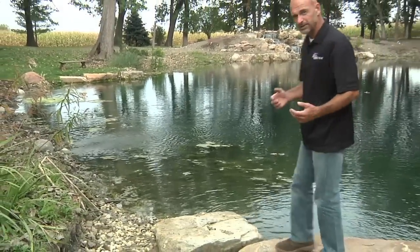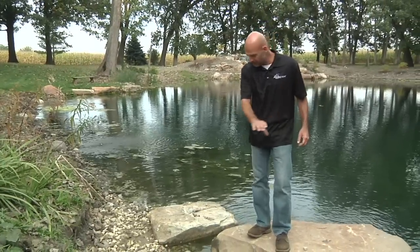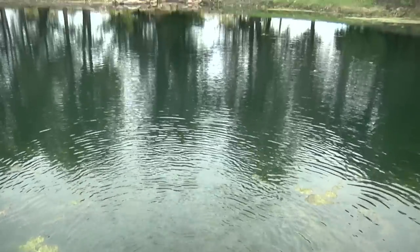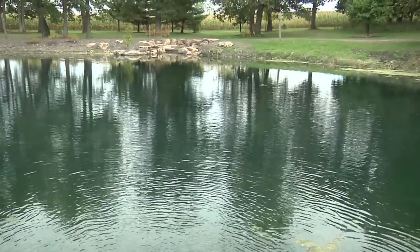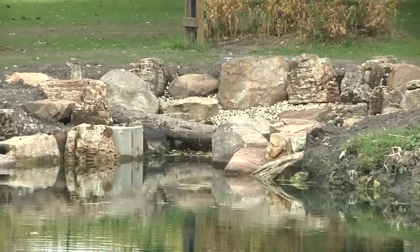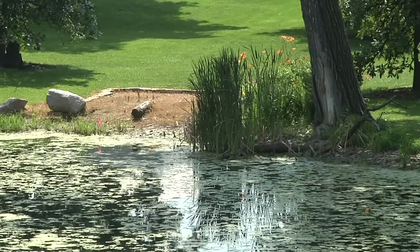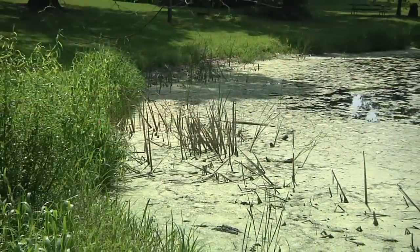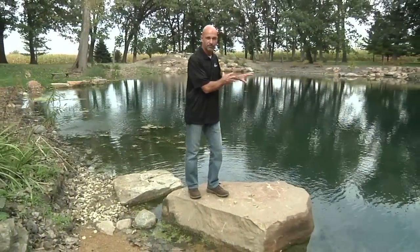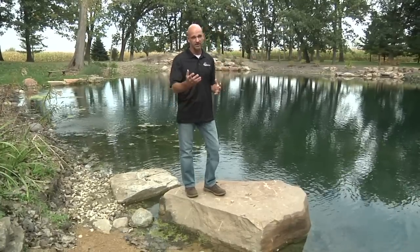I'm at the far western edge of the pond — this is where our jets are located. We have a piping system running along the perimeter with a series of jets every 20 feet. What we're doing is pushing all of that debris over to our skimmer system on the far eastern edge of the pond. Just like our small ponds, it's all about circulation. We had a big dead spot over here — this is where all of that duckweed was accumulating. So having these blasts of water is just pushing everything to that far other end where it can get sucked into our skimmer.